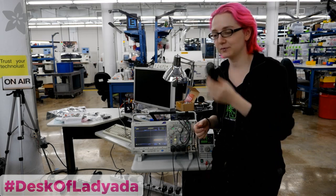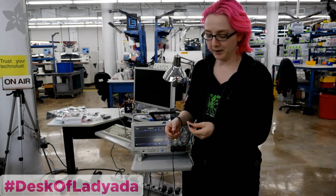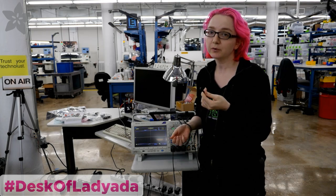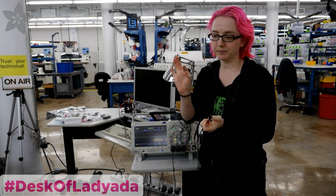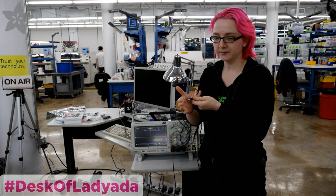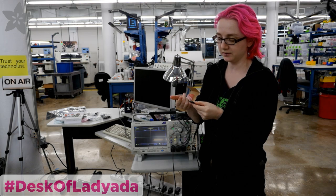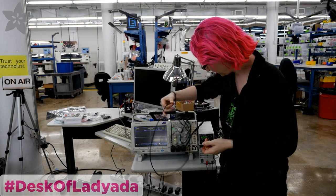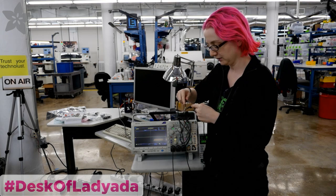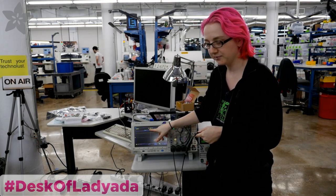So to start off with, I'm going to plug this in. It's plugged into the power plug and then connected to a six-inch micro USB cable. It's power only, of course — there's no data. I've got this little micro USB breakout; I don't want to slice this cable apart, so this just makes it easy. I plug this on and then I soldered two little pins onto the breakout so I can connect to ground and five volts.